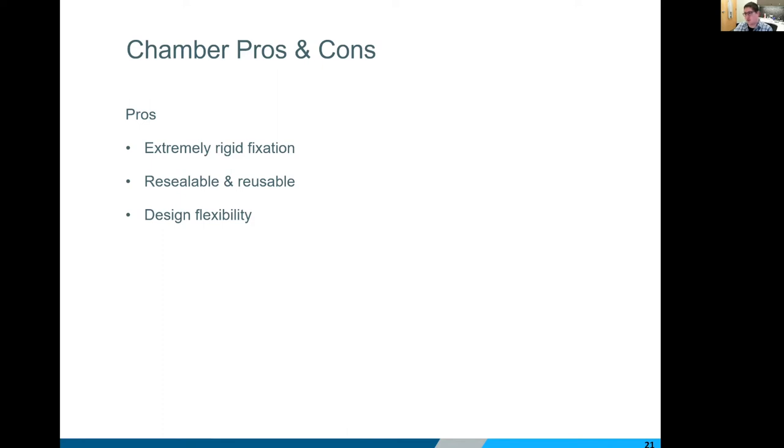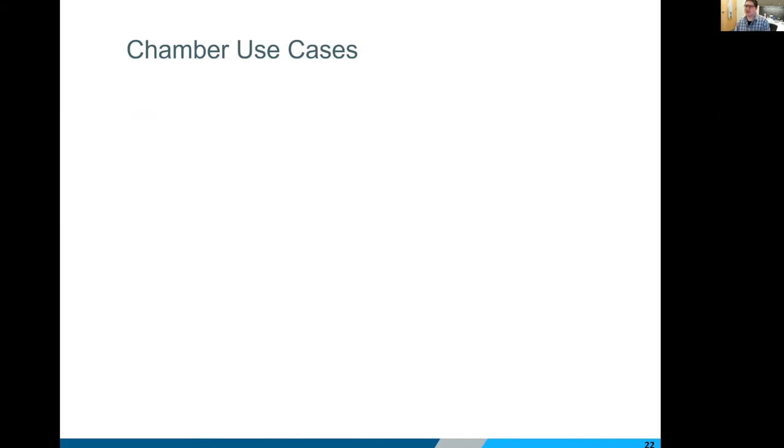Design flexibility is a big one. If you want to include a head post for fixation, slots for micro drives internally, a slot for an optical cannula, and another slot for a drug delivery port, all of those can be included on a single device. Because we have a ton of flexibility in-house with 3D printing and our machine shop — with some pretty talented machinists on retainer — you can integrate all of that hardware into one device, simplifying the surgical procedure to just one implant. The downsides: because these are bespoke devices, they will incur some custom design costs. Also, if you're doing imaging studies and you throw a big chunk of metal on the skull, you will see artifacts — especially for MRI, that's a big no-no.